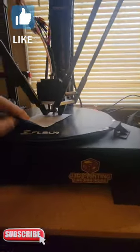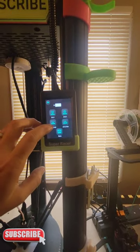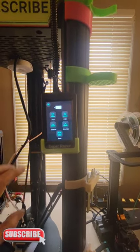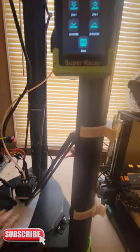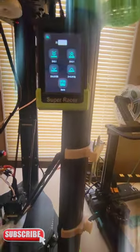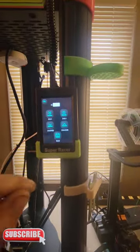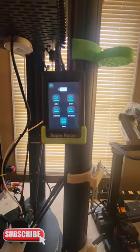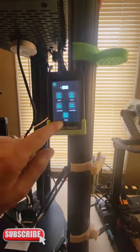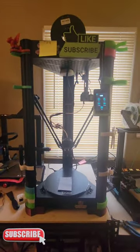There we go — I'm gonna drop it down one more just because I want it a little tighter. Yeah, we can get it a little tighter. One more. All right, that's where I want to be. But if I was to click up and save it, it will not be accurate — you have to start the whole process over. So always save on a downstroke. Watch — save. Now when it comes back down it'll be right where I put it.